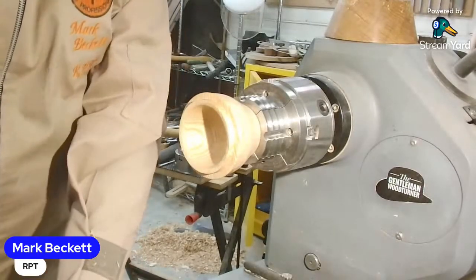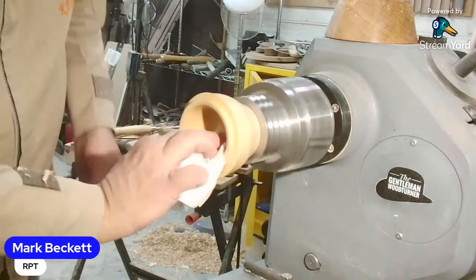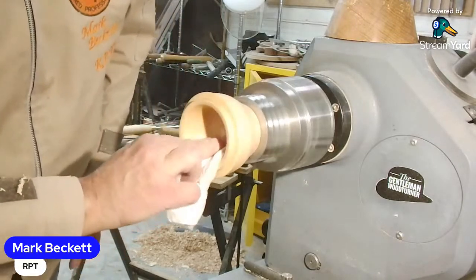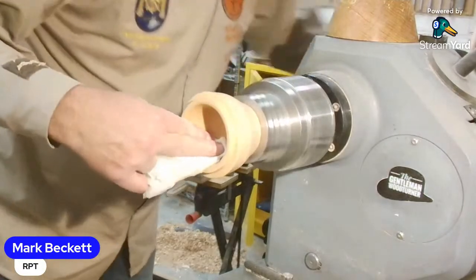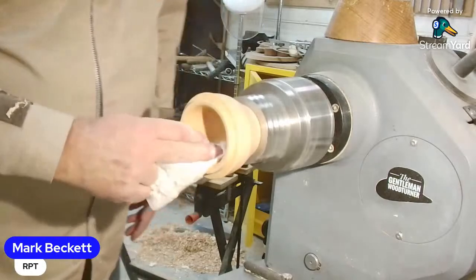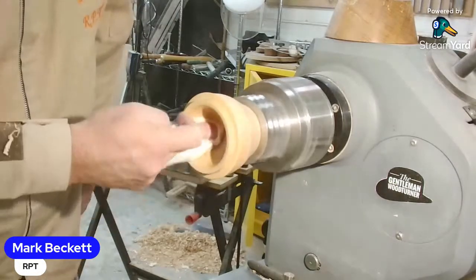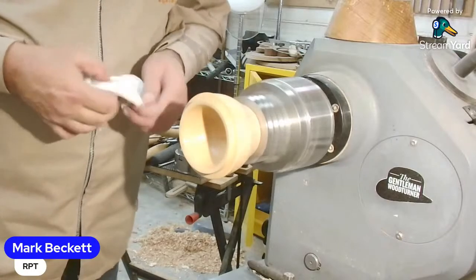Yeah, I tested the Robust one when it first came out, and the way it operates is that you pull a lever and the bed actually rotates and turns towards you. And you wait till they get down to the height that you need to work at, and then you lock it in place. How does the tool rest work with those that tilt forward, though? It goes with it. Does the bed come down so it's still horizontal, Ruby? It's not horizontal. It's kind of on an angle. Right. Okay. And the One Way operates basically the same way. It just always puzzles me how the tool rest works, that the banjo obviously tilts with the bed. Yeah, it's quite different.